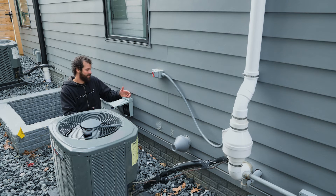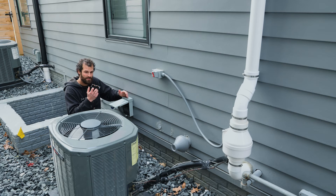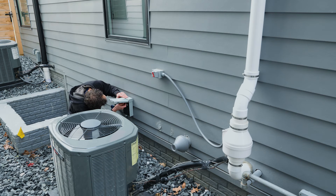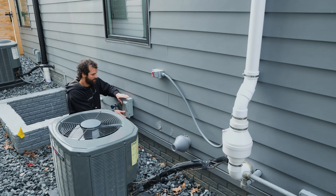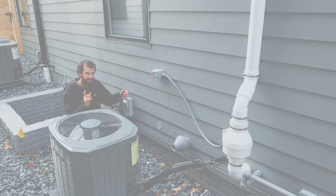Not a big fan of what's going on here. Now, this pull-out disconnect for the air conditioner — it's turned off simply by removal of the disconnecting means. It can then be reinserted inverted 180 degrees, and that will be the off position. I'm going to reverse it to put it in the on position — it only fits in one way — and get a good tight fit. Now my air conditioner is operational and, because of the disconnect, safely serviceable.